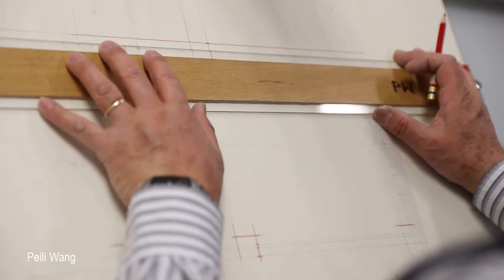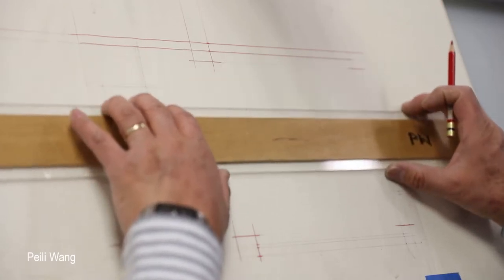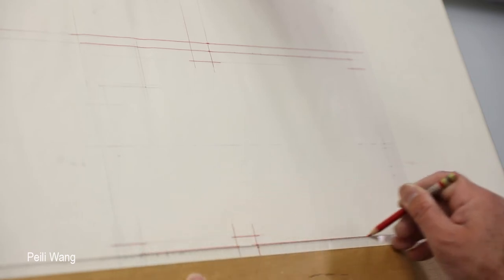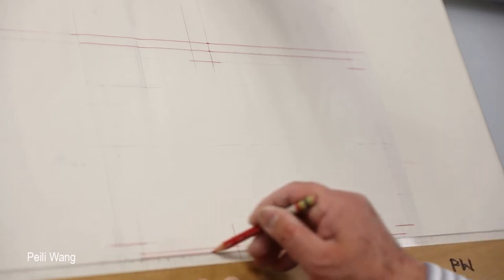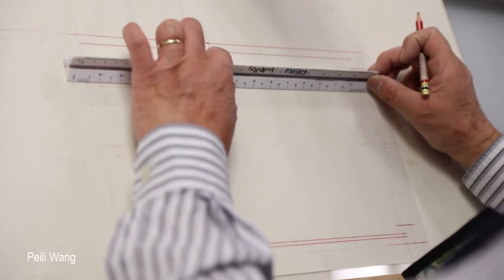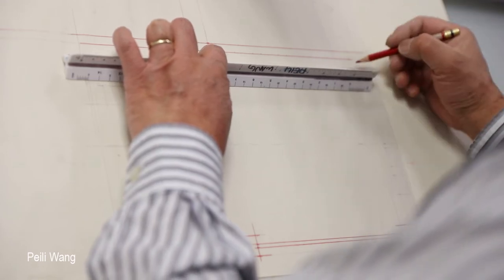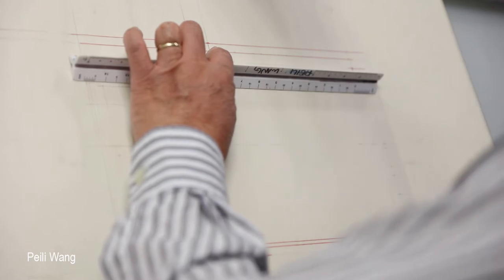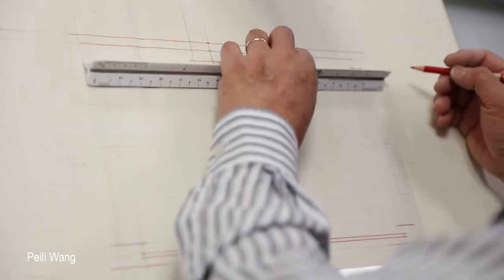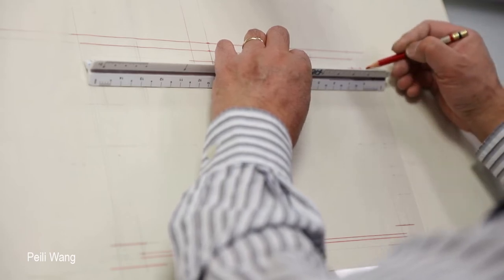Here, here, here, and this part — wall thickness. Push — this is not final ink. I can do anything I want. So this is really better. And also exterior — take a red color. Use quarter inch. You need to measure how far from this point to this point, based on your measurement. I find it. And how far from here to wall — you measure that. The thickness for this wall — I said one foot three, based on your observation.